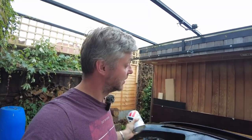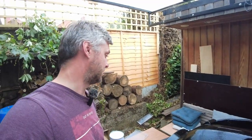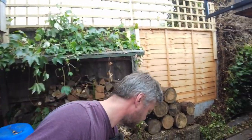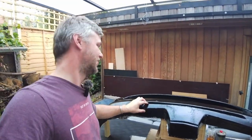Coupling coat is basically like a middle coat with a thinner weight fiberglass, so 100 grams, 200 grams. You apply one coat of that, put your fiberglass on top, and that basically helps stick the main reinforcement, your four or five layers of the thick stuff, to the gel coat itself. Wait for 3-4 hours before it gels, and then we can apply normal resin, which is this tooling resin. 5 kilograms should be enough. I've calculated that's about 0.8 square meters, so hopefully it should be enough. I have some other resin, so it wouldn't be too much of a problem if I run out, to add another few layers on top afterwards, but it should be enough for 3-4 layers. Let's mix the coupling coat, cut some fiberglass, and apply the first coat.